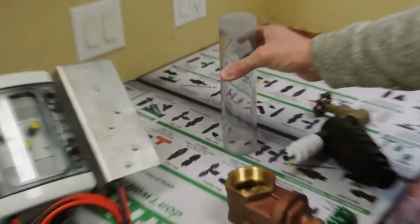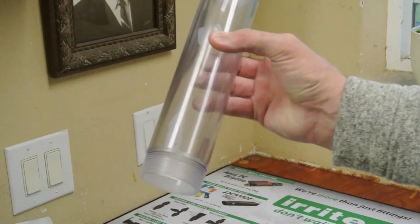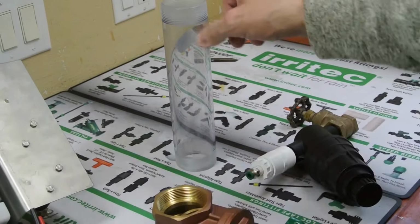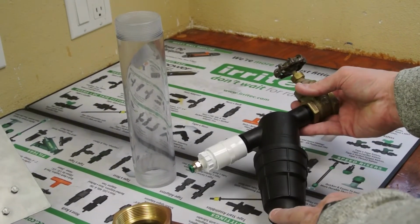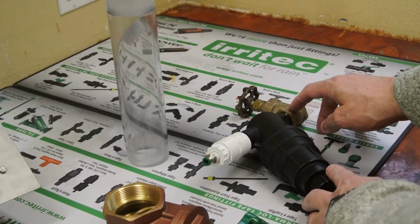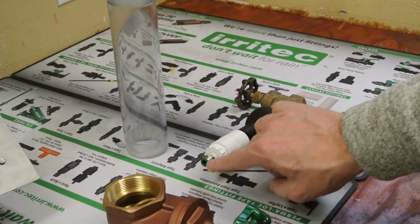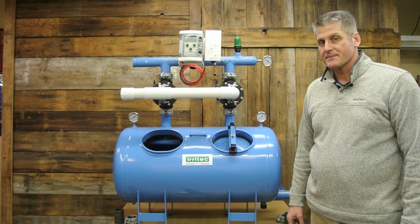You're going to want to purchase a sight tube to match the size of your backflush pipe. You're going to want to purchase a gate valve for that sight tube. And you're also going to want to purchase a 3/4 inch Y filter with a gate valve 3/4 inch or a ball valve 3/4 inch, and the fittings that it takes to come out and get to 250 tubing. So now from that parts list, let's show you where all the parts to the DCM filter go.